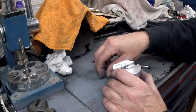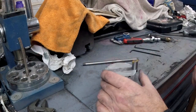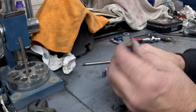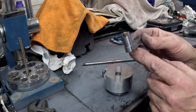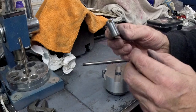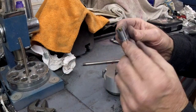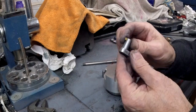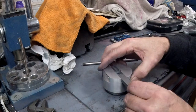We've got the two slugs, a handle, a little cross slider with a cutting tool set at an angle — whether that works out or not I don't know. It does need nipping up tight there. If I've got a failure point, it's probably going to be that, because everyone I've seen making this machines it out of one piece, or makes a heavy section — Steve Jordan did one and put a bolt in the back with a sleeve and a big pinch bolt. That's not how mine works, and that really might be the failure point — it might pull round. I'll nip it as tight as I can but it's only M5, so that could be a weak link.